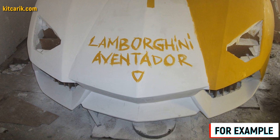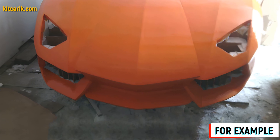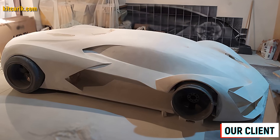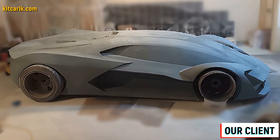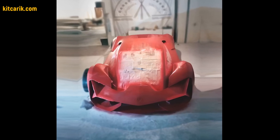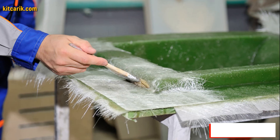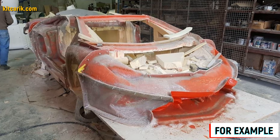Before making the fiberglass molds, we need to prepare the surface of the layout and protect it from adhesion — adhesion means sticking. If you do not cover the model with epoxy resin, varnish, or any other suitable substance, the molds will stick to the model and you'll have to tear off the putty. There is detailed information about this on the internet. Next we make fiberglass molds for the further production of a fiberglass body, body kits, and parts. Mold making is not a complicated process — it is better to make molds for each detail separately.